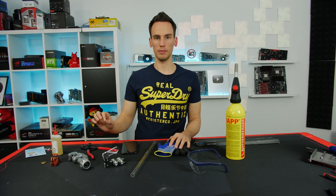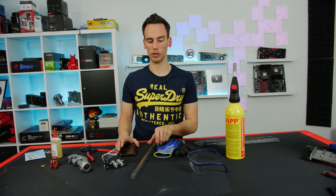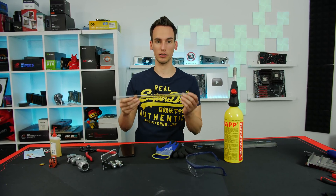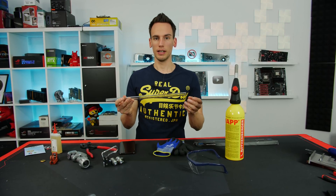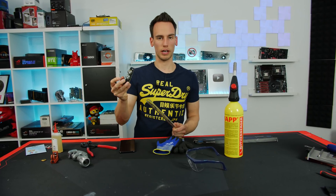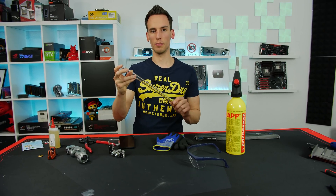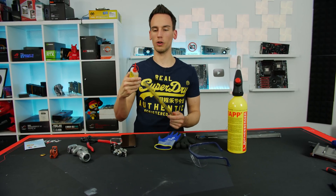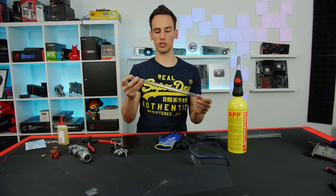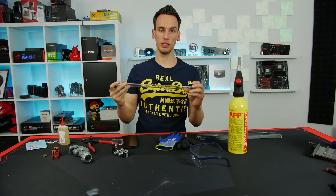First of all I want to thank you for leaving so many comments in the previous video about cutting those glass tubes. It's pretty much my first time cutting glass tubes - I have zero experience and wasn't sure what to do. That's why we built our own tool, which worked kind of nicely. Some people suggested I try using oil on the cutting wheel, and also to only do a single rotation with not too much pressure - just scratching the surface and then breaking off the tube.